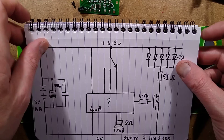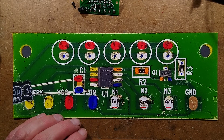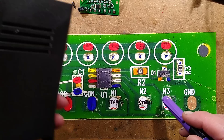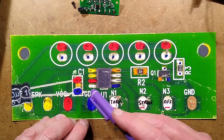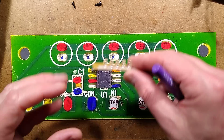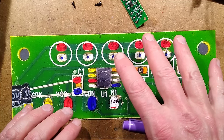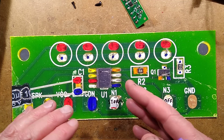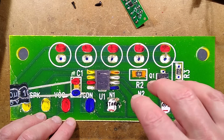They could have just left that floating, surely? Or maybe they need it pulled to a particular logic state, but then the others are left floating when the switch is off. Strange little circuit — very annoying little circuit. I think the best thing you could do with this is actually hack it to just power the LEDs directly via a resistor and use it as a little LED floodlight, because as a strobe it's very weak. And as the lightning effect, it's just annoying — I would have thought they could have written the software to strobe every so often with a pause, then another burst with maybe a different sound effect, alternating between a few sound effects with random delays. But the fact it just repeats the same effect over and over again is actually quite annoying.